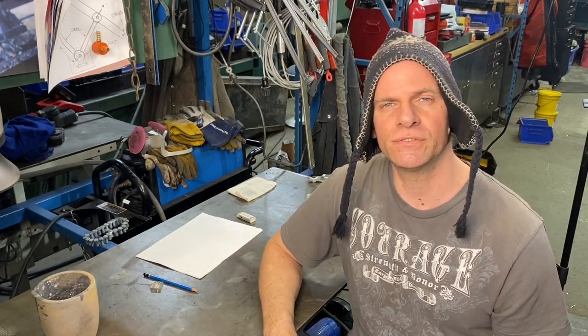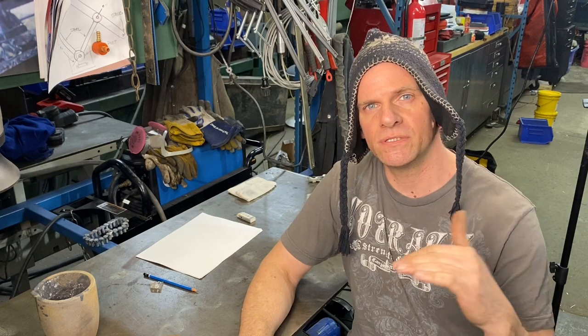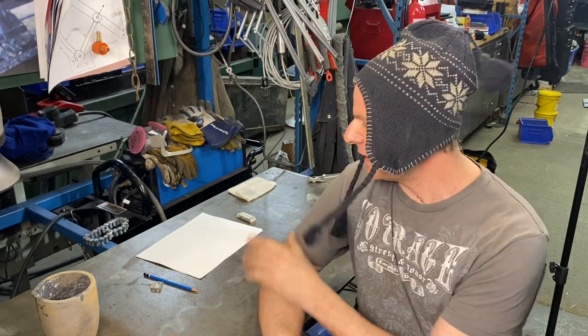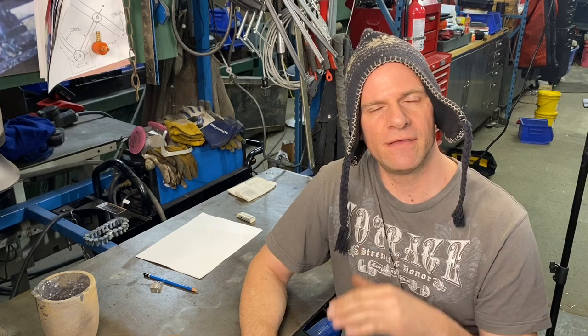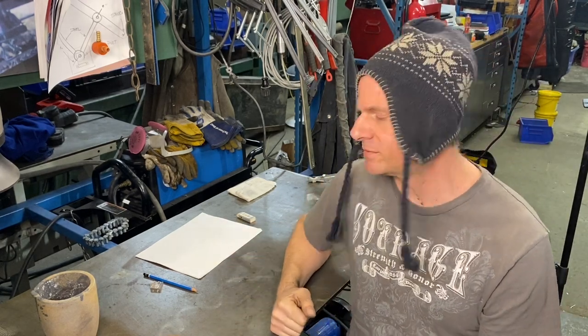We're also going to need to have something like a mold that we're gonna pour the molten copper into. So that's what we're gonna make next. And I'm gonna do a couple of drawings up. We're gonna use a 2.5 inch round tube. We're gonna split it in half, and then we're gonna weld two ends on it. That's the basics of our mold that we're gonna use. So let's do some drawings up and let's get into making that mold.